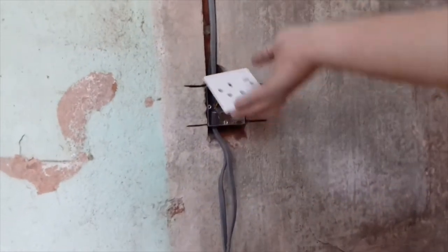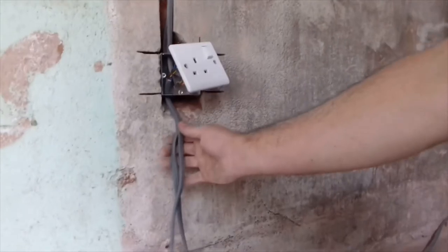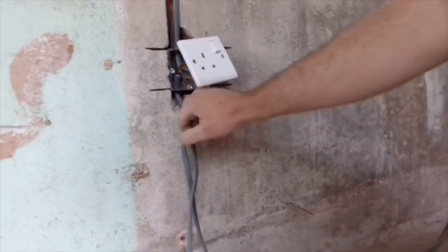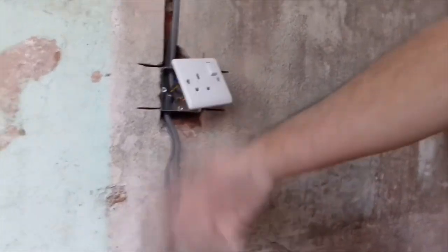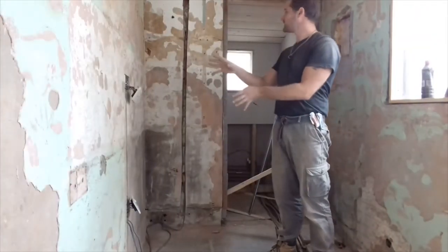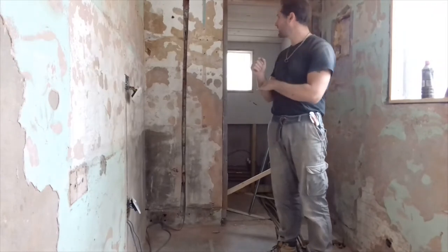And the same down here. What I've done at the bottom there is I've channeled out this little slope here. The reason being, this wire is not being channeled in, so we need this little slope just so it can ease out so you're not bending the wire too much. So what I'm going to do now is fit the sockets back, do my cappings, get it all bonded in for the next video. I might do it then, I don't know.